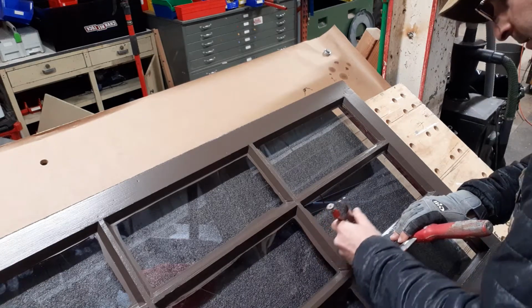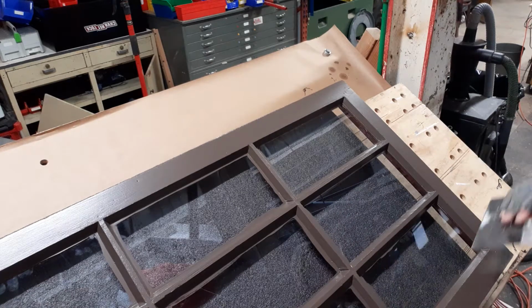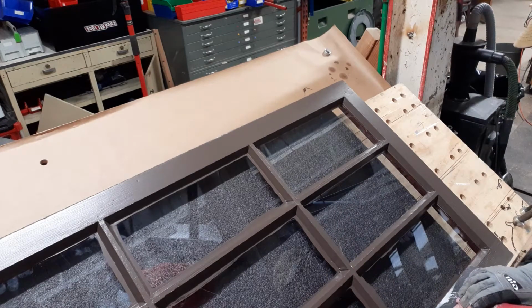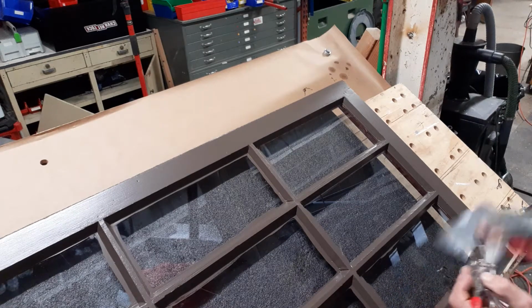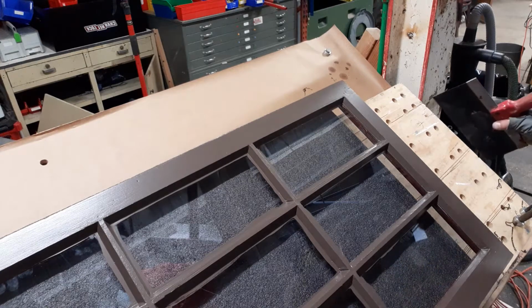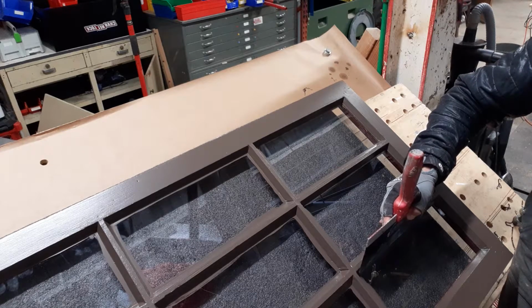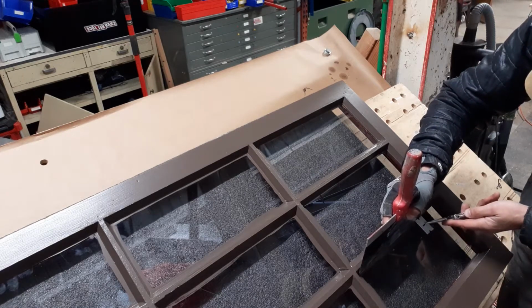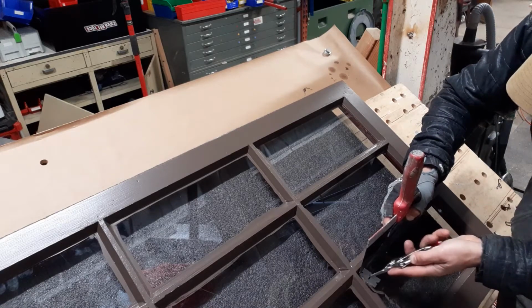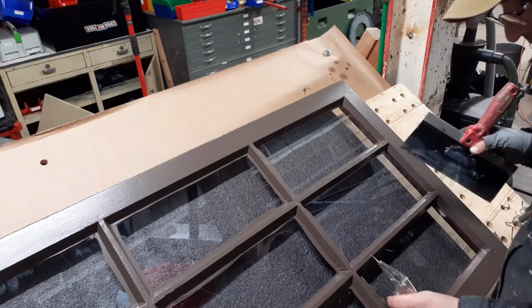You know, I wonder if a little GoPro camera would be handy. That's kind of nice and convenient as it lands on the taping knife. Cut into your corner and go along. You will be revisiting that corner, so you don't have to be too critical. It's almost like glazing. You're always addressing the corners. There, that's it, okay.